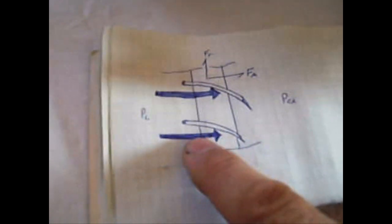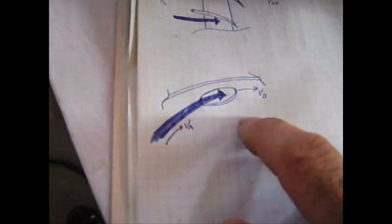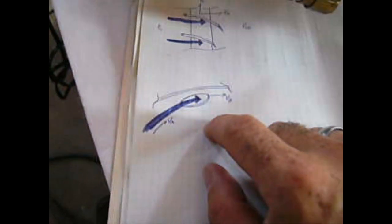In this case, the rotational velocity of the rotor doesn't necessarily equal the velocity of the medium going through. So these attempt to match. And because of the viscous nature, you'd be amazed how much force can actually be exerted as a result of this frictional drag of the medium going across the disks. So what you have is a simple, easy to build design, which is super efficient.